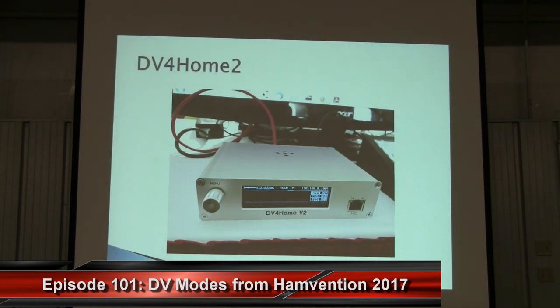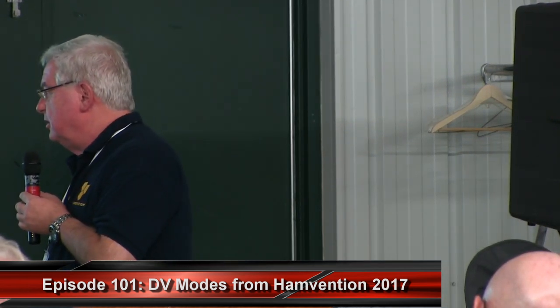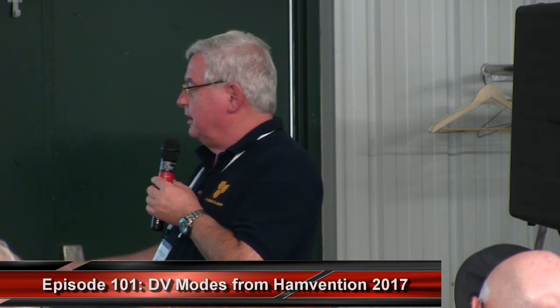What we can ship next week, or let's say June, is the DV4 home version 2. The DV4 home, for those who don't know, is a purely internet-based all-mode radio — you can do D-STAR, DMR, Fusion, P25, and NXDN with it. In its basic version it doesn't even have RF, but you can do all modes. It can do cross-mode, meaning you can put in a DV4 mini on the back running D-STAR and then work Fusion or DMR back to the network. It has two AMBE chips inside and translates any mode.